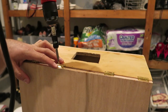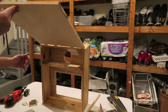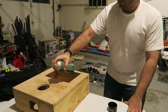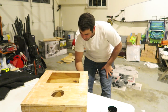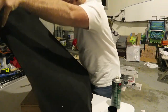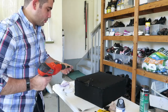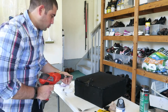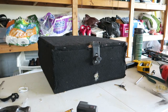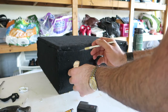On the top I added small brass brackets to be able to swing it open from the back. I then applied 3M adhesive spray across the entire box and laid out black fabric. Another option would be to stain the wood, depending on your preference. Since I plan to leave this box unattended at events, I added a lock so I wouldn't have to worry about the expensive gear inside. Before cutting out the porthole for charging cables, I cut away the fabric first — this is important so the fabric doesn't wrap around your drill bit and break it.